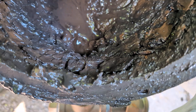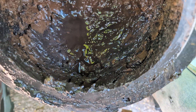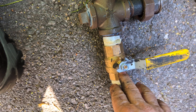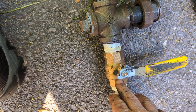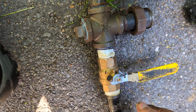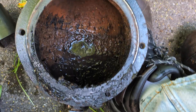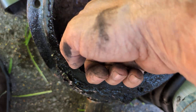The bottom is partially occluded, so you're not getting really good flow. Prior to the installation of this valve earlier this year, there was a restricted port gate valve, which had replaced, of all things, a globe valve — which was, of course, not going to work to remove the goo from here. You can see this stuff is pretty bad.